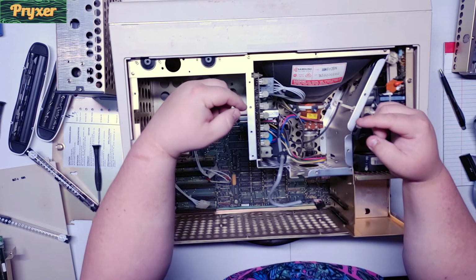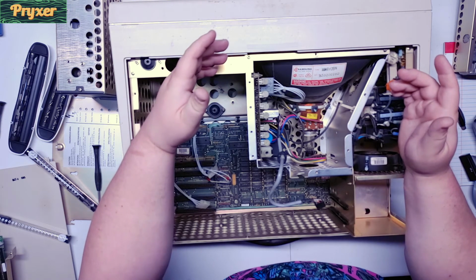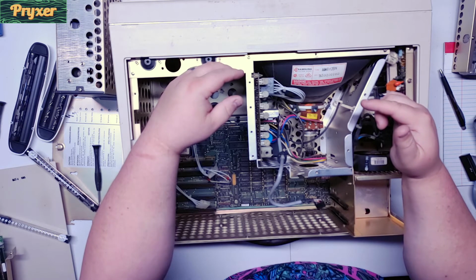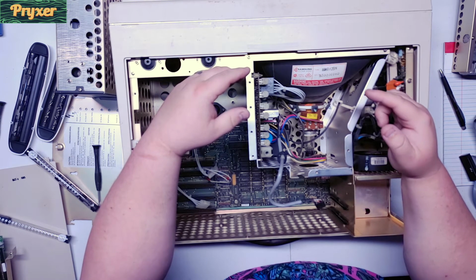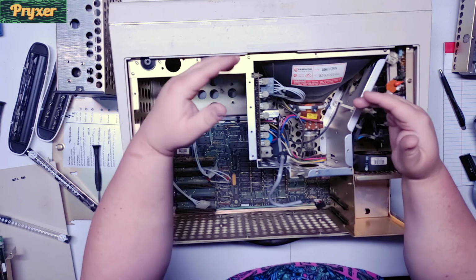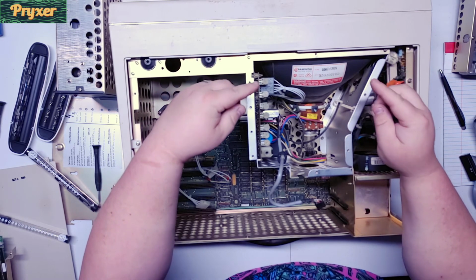I've found on a couple of the chips so far that there is what looks to be some kind of oily substance, almost like this may have taken some liquid damage at some point. So that could explain our little black line of smoke. Not really sure. I haven't seen any kind of tracing that's fried. One thing I pointed out earlier when I pulled the, essentially it's the video card, on the back of that you can see where a trace was jumped with a wire. That's not uncommon on older boards. Sometimes you just had to jump a trace with a wire if something wasn't performing how you wanted or you wanted to do something different. It's totally common practice, but it's cool to see that old school knowledge, somebody knowledgeable enough to know which trace to jump to which.